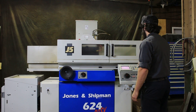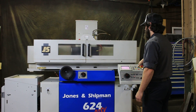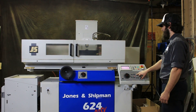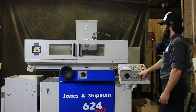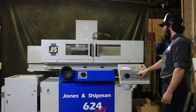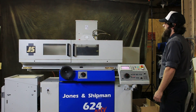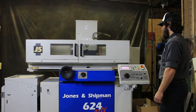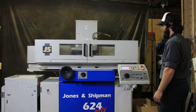You're going to go into an auto cycle. Again, you can vary how fast your table moves back and forth through the control. It's taking ten thousandths at a time on its roughing passes, and then it's going to do five thousandths once it hits the fine increment. Right now it's just doing a basic plunge grind with table reciprocation. It's going to do three or four plunges, and then it'll come up and it'll do its fine surface grind at the end.